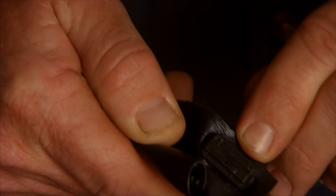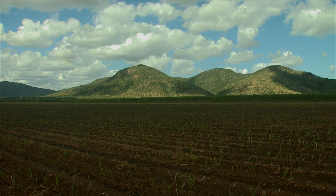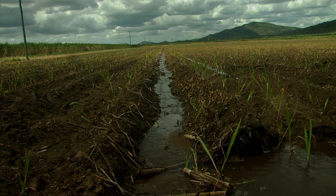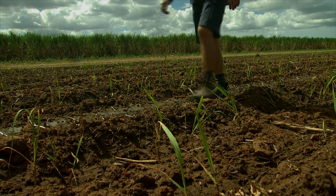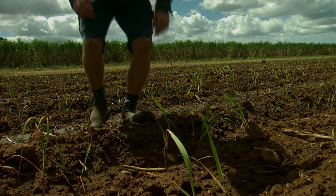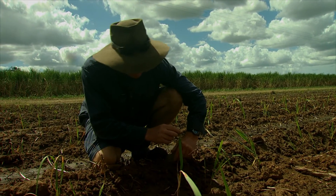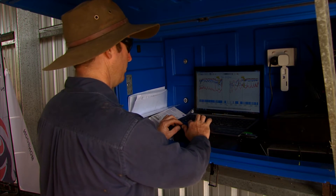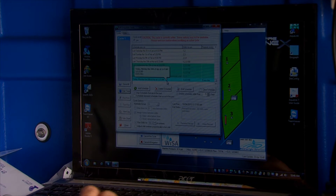The drip system offers some clear environmental benefits. Gradual subsurface application of water and fertiliser minimises the potential for nutrient runoff in rainfall events and limits deep drainage into the aquifer. And because there's no water sitting on the surface, weed growth is limited, cutting down substantially on the need for herbicides. Another added benefit is that the system can be monitored and controlled anywhere there's access to a smartphone and the internet.